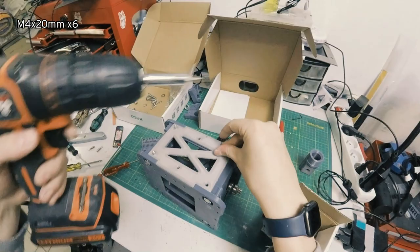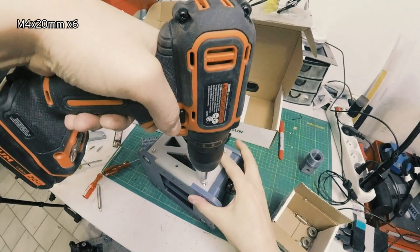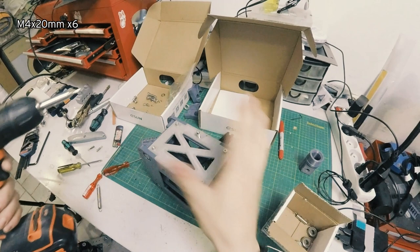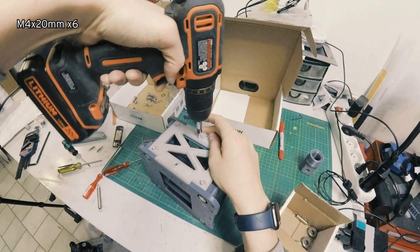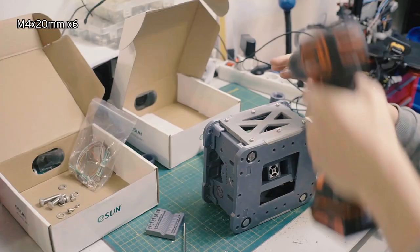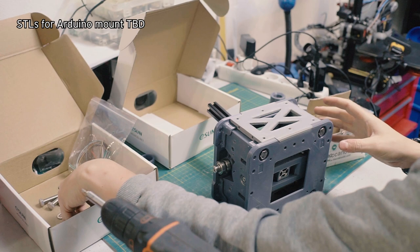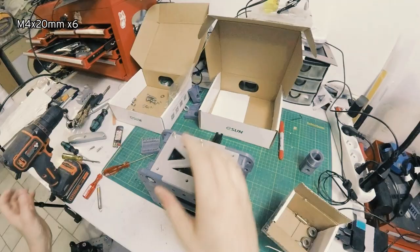Now, in the design, it's open because I'm trying to keep everything under 1 kilogram of filament. In the future, there'll be an expansion set of files that enclose the gimbal completely, other than where the stick comes out. And we'll obviously put it over the 1 kilogram amount. And there's still other files to come for this design, which will come when I release it, which is the mount for the Arduino. But I just haven't designed that yet because it's not a priority at the moment. Because for testing, I've just been using a breadboard. But that'll come, and that'll keep it under 1 kilogram.